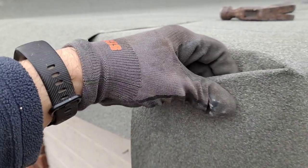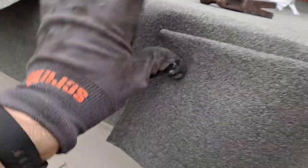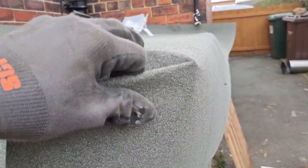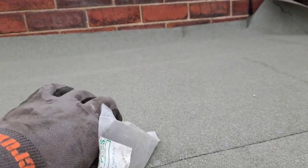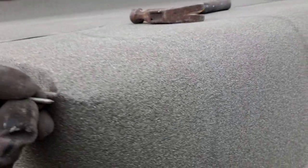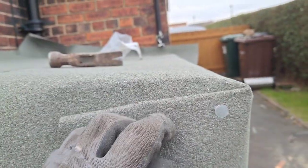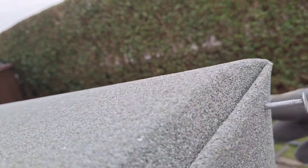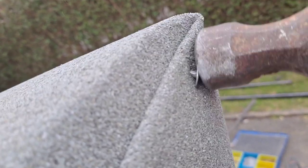But the corner needs to be folded — it's a bit like folding a bed corner. So what you do is you just tack that in like that. I've got the three-quarter inch tacks here. Just grab a couple of tacks and I'll show you what I mean — I'm holding the camera so bear with me. Tack that there and it should hold that in place. Straighten the clout up — there we go. Then you hold that corner in place like that.